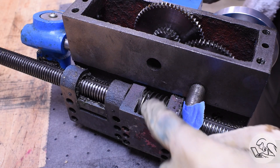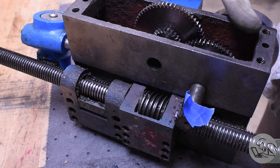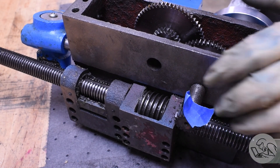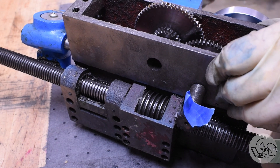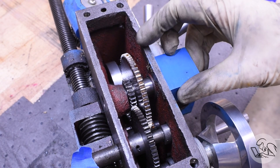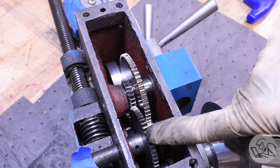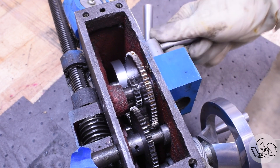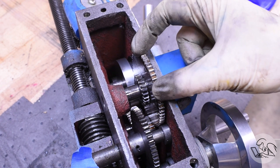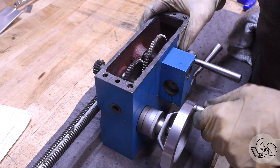This is a great chance to see how the keyway drive works on these small lathes. There's a worm gear that slides along this keyway, and as the lead screw turns it taps power off of that keyway without actually touching the thread, so you don't wear out the lead screw but you don't need a separate drive shaft for the power feed — it's a nice compromise in these mid-range hobby lathes. When I engage the power feed for the carriage it slides those gears forward and that worm gear drives the primary drive on the pinion that moves along the rack under the front of the lathe bed. Going back to neutral and then over and down slides the gear the other way and engages a gear upwards behind the hand wheel on the cross slide — that's the power cross feed.